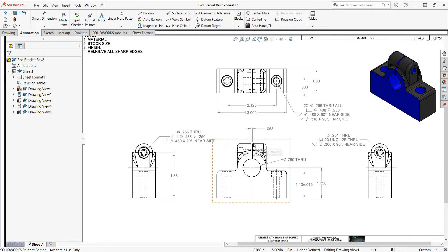Next, on the front view, I see the slot is also on center because I have a center line. I have its width. I have the hole size - if this hole had a tight tolerance I would need to go ahead and edit this to get the proper tight tolerance. I also have the hole location: from the bottom machine surface to the center of the hole is an inch and a quarter, and again the center line shows the hole is on center of the part.